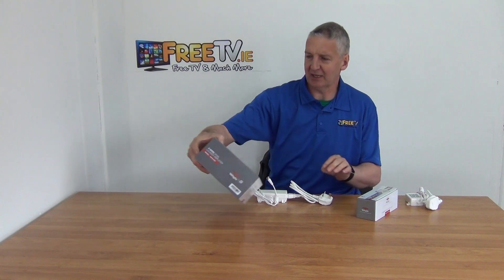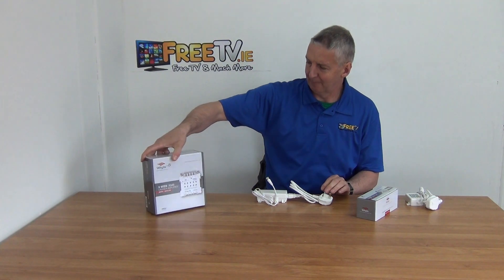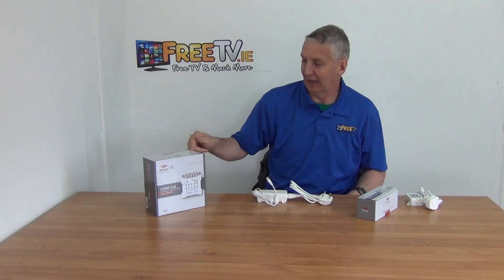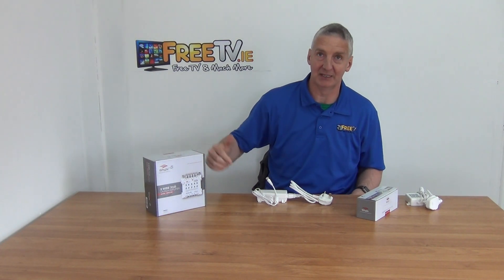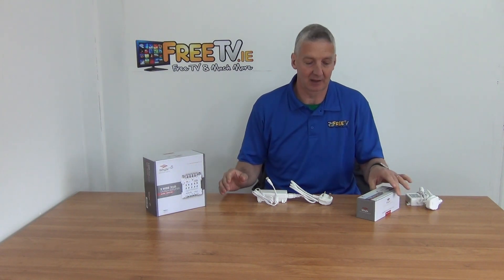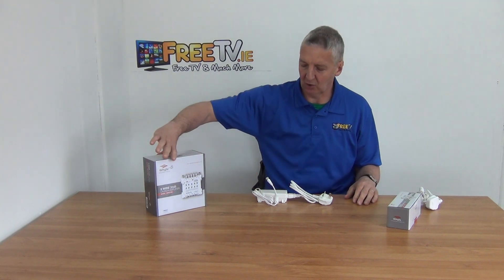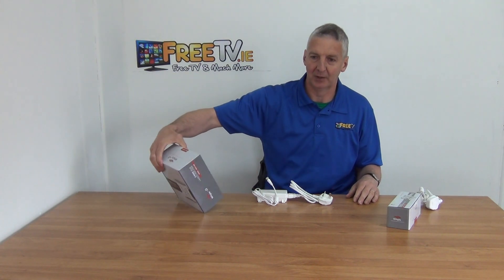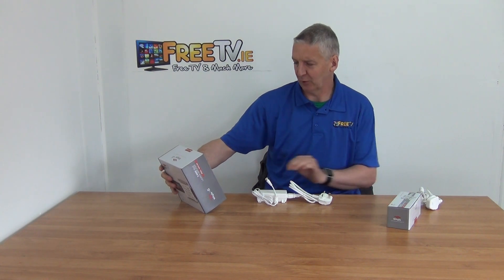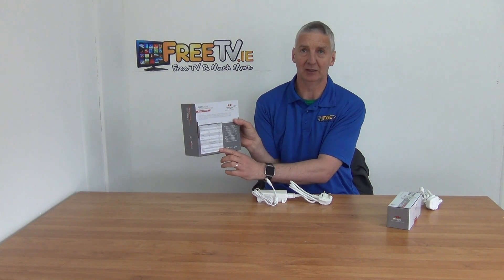Say you have a launch amplifier and you want to decide whether to add a power unit onto it and what size of power unit to use. Well, it's always going to be 18V regardless, so that's a no-brainer. Then you have to think about whether to use the more expensive 2.5A or go for the 0.8A. The first thing to do is just look at the back of the box — it says power consumption is 290mA.